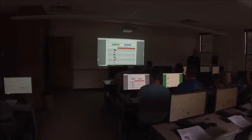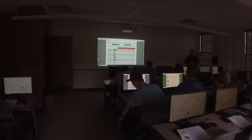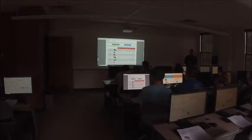Basically, the free load speed is, let me back up a second. Before I go into that, all the stuff I'm going to be talking about right now, especially on this website, is when the motor is given its operating voltage. So when you look at a data sheet for a motor, it's going to say this motor is for 12 volts or this motor is for 24 volts, right? So all the testing is done right at that voltage.